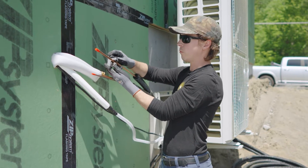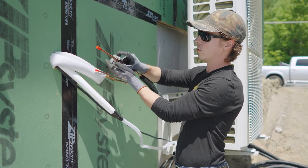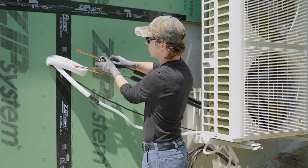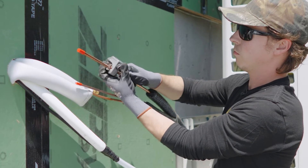When using these cutters, if you haven't before: typically you want to tighten it down, go one full rotation, and then tighten a half a turn. Continue to do that until you make your way through the copper and get a clean cut.